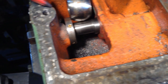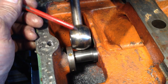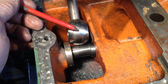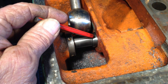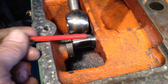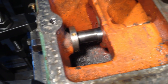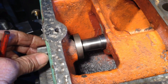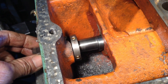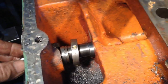Right, so we've made our locking collar. So the pull stud type thing goes on the cam here. And I also made an extra little bush in there to limit its travel going that way. So that should solve our problem. So yeah, can't go in any further.